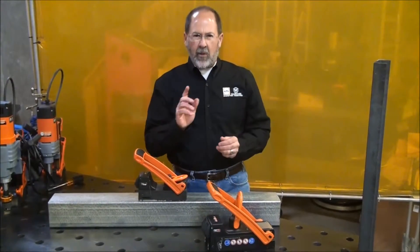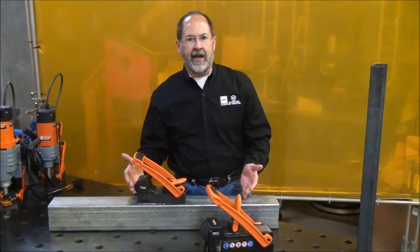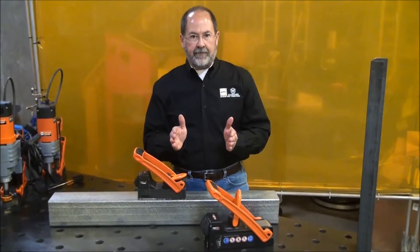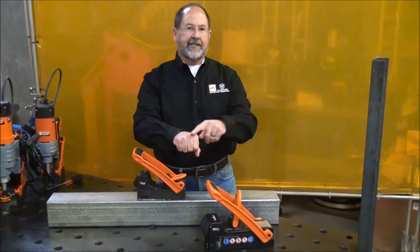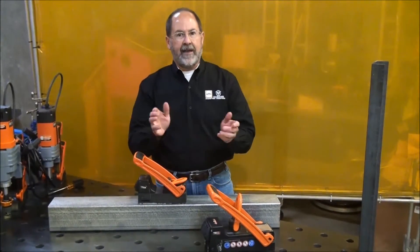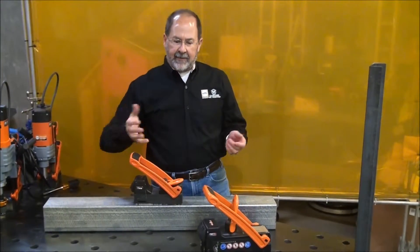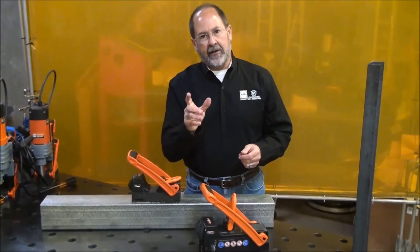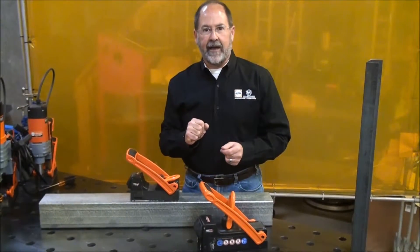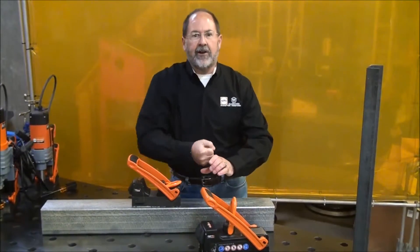So what difference does it make? When you get to thinner and thinner metals, you're not absorbing the energy when you're turning the magnet on. When you go to turn that magnet off, those handles will spring back at you. You're probably familiar with those arm-wrestling style handles that you have to crank over 90 degrees. I've seen a lot of scars on a lot of my customers where they've had to have surgery after that handle flipped back at them violently. Maybe you've seen ones where you have to crank the handle around 180 degrees on top — same kind of thing, only it takes thinner metal to make those come back so violently.